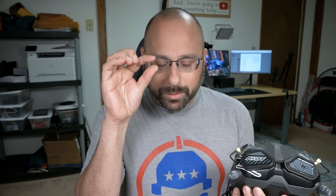There is a setting in these goggles that, if it's set wrong, it means that the goggles never go to full power. They stay down at this little 1mW-ish output power, and then you get terrible range, and you wonder why — and I'm gonna tell you why.